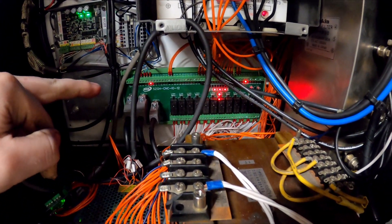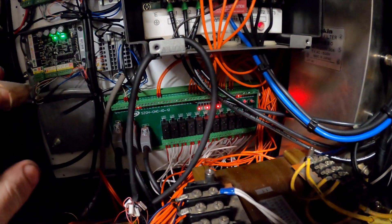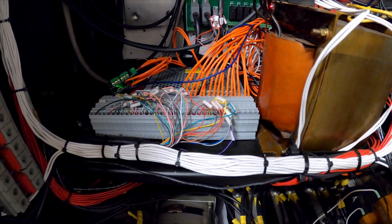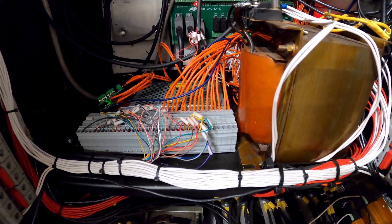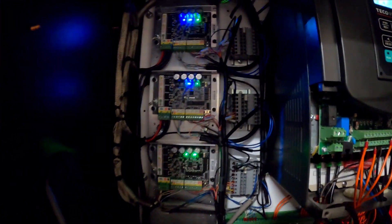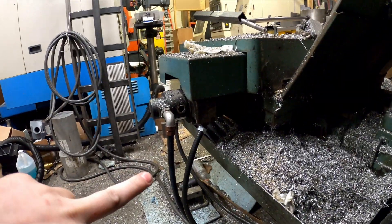This is the relay board for the control I got — it controls all the solenoid valves for the tool changer. Also these wires here are the proximity switches. So if there's a mishap with the tool change, it knows if it's missed a spot where it needs to index to — those kind of things. And then these are the servo drives — these are DC, as I say, I kept with the original servos.